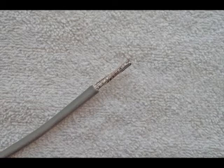This cable also has a ground wire which you don't necessarily have to use. Should you decide to use this ground wire, always twist your ground wires together wherever you have these cables. If you have more than one cable on an RCA connector, connect these ground wires together and tape them out of the way.